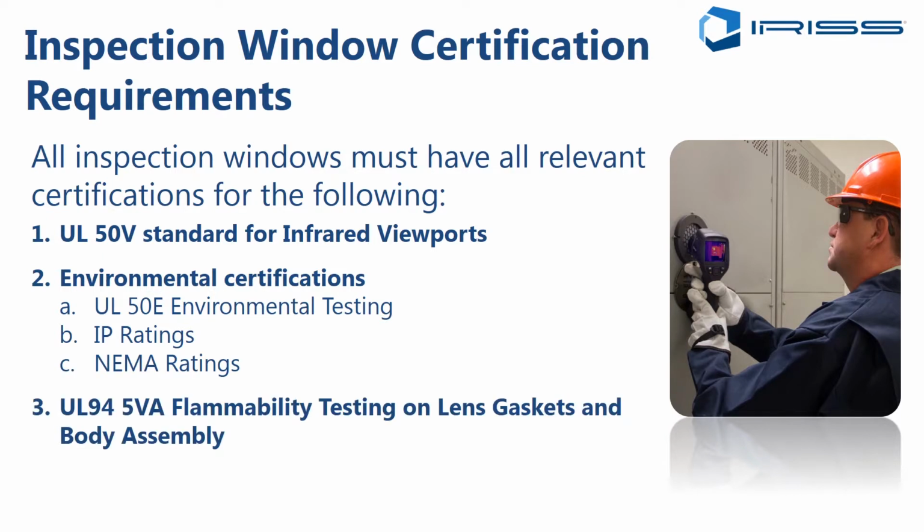You also want to look at UL 94, the 5VA flammability test. And this is important on any, again, windows that have any kind of plastic or polymer material as part of the assembly, whether that be the lens or the body. The UL 94 test is a flammability test, right? And it's for all switchgear rated plastics must undergo this test. And so if you are utilizing an assembly that has any kind of plastic material, look for that from the manufacturer as well.